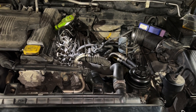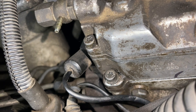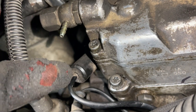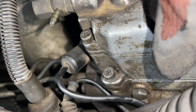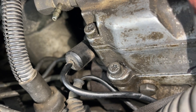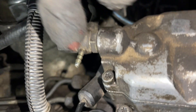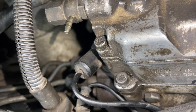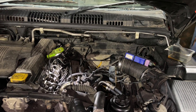I made a big mistake — the markings I put are in the wrong place. The marking should be on the base of the pump body down to the fixed lower section, but I stupidly marked the top cap and the middle section, where the middle section is actually part of the top. So now that section moves and the bit I didn't mark doesn't. Don't make that same mistake. All I can do is go off the dirt marks left by the bolts on the casing and start it to see if it runs okay.